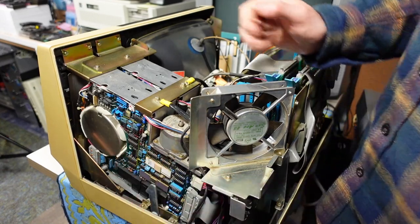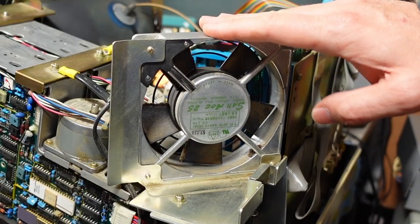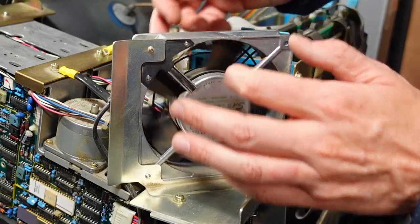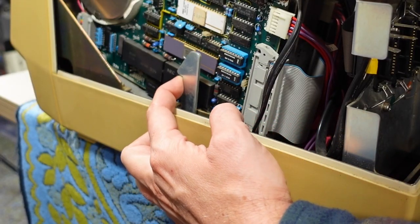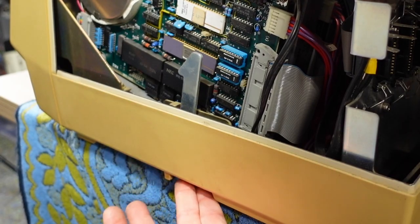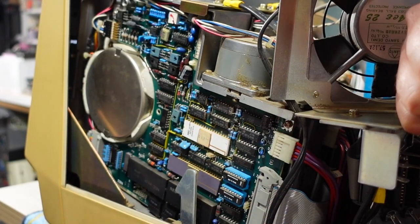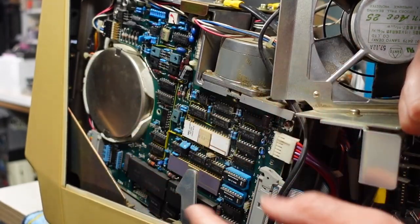Unlike the ones I've shown before on the channel, I think the spindle motor runs at 24 volts on these, so no mains voltage required. There's a San Ace fan here that unlike modern fans runs at 115 volts, and the fan surround is actually die-cast metal — only the blades are plastic. I'm marveling at these disc drives — there are some nice ceramic gold packages on here. I am seeing lots of tantalums though, so there is a possibility of short circuits given these are in the perfect age range to fail.